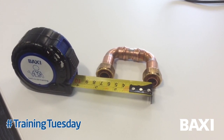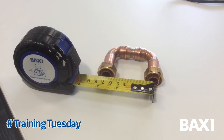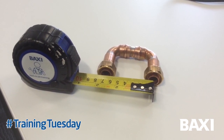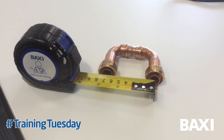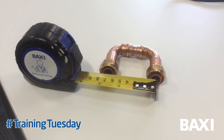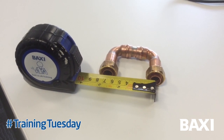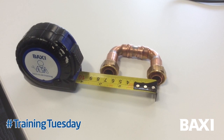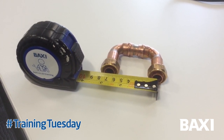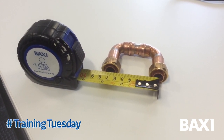What you need to do is just take a minute before you start piping and make yourself a temporary brace like I've done here. I've utilised two half inch tap connectors and two 15mm street elbows, but you could use standard 15mm elbows. You can make this remotely off the unit, or take the blanking caps off the return and cold water mains isolating valve and make it in situ. If you're making it remotely you need to be at 65mm centres as shown here.